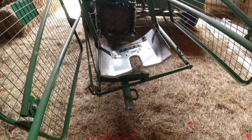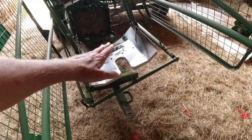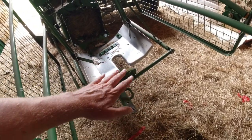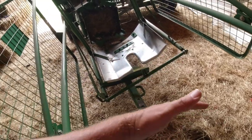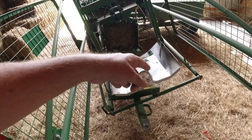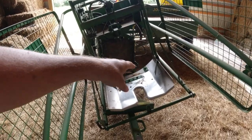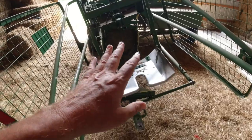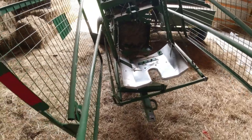it may not kick it, or if it does, it may flip into here. Or the next bale coming along might be a combination, and it would kick, and the one in front of it might flip. It might keep that next bale from going out. The pan kicker clears itself from it, and when it comes back down, it's laying on top of a bale. And those of you that have pan kickers, John Deere, you probably know what I'm talking about.